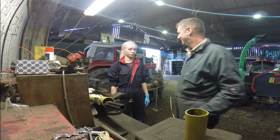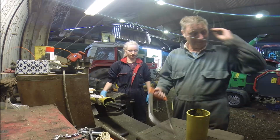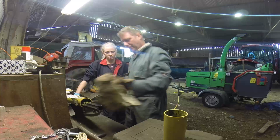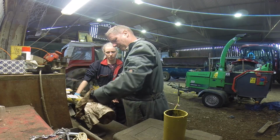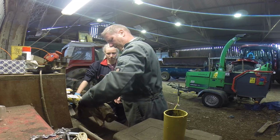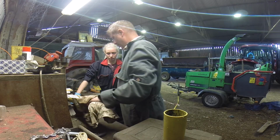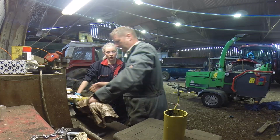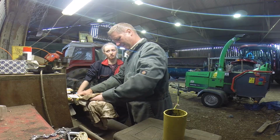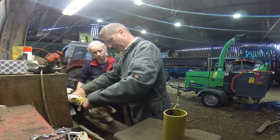I'm surprised. So we need to get some of this grease off of here. I've got to get that grease off. Because the thing is, when you're grinding, a lot of swarf. Swarf is grinding bits. Why don't you just say there'll be bits? Because there'll be bits of ground metal. Yeah, just say that. And mixed with grease, it acts like a grinding paste.